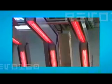The unit uses 3000 watt glare-proof shortwave ruby red infrared lamps that reach full operating temperature in 1 second without any pre-ignition. And they cool practically immediately. These lamps have an expected lifespan of 20,000 hours.